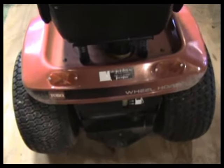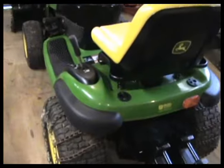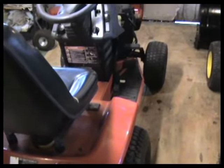What I like about this one over the John Deere is the Deers have Tuff Torq hydrostatics that aren't really serviceable — John Deere basically says you need to replace it, although you can go to Tuff Torq and get all the parts and fix them. But these Wheel Horses have a very serviceable hydrostatic drive with separate reservoirs, and you can get all the parts and pieces right from Wheel Horse easily. We just gotta get this one going and see what it is.